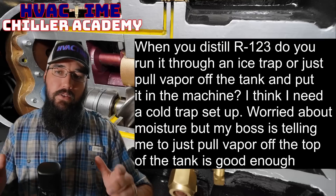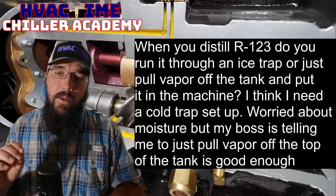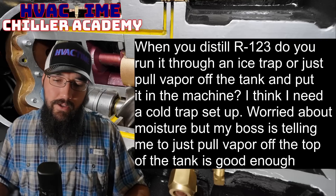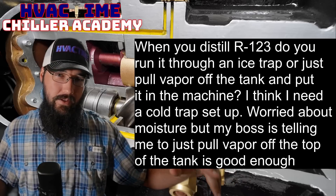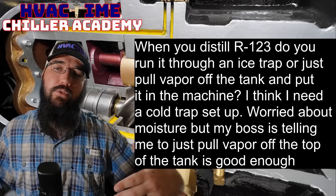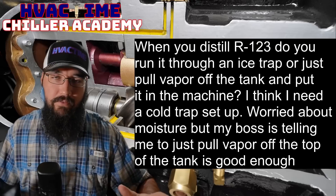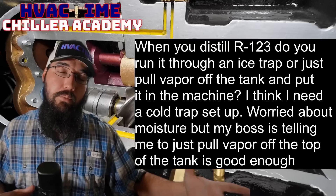There are a couple of ways to go about this, but I want to respond to the recommendation by the boss first. The boss says just boil it off and it'll be good enough. Now the boiling point of water — to get it to boil at about 75°F — is like negative 14 PSIG, which is significantly deeper than you would have to pull most refrigerants. Most refrigerants we can boil well above water's boiling point by the pressure dropping at a reasonable ambient of say 70-ish degrees.